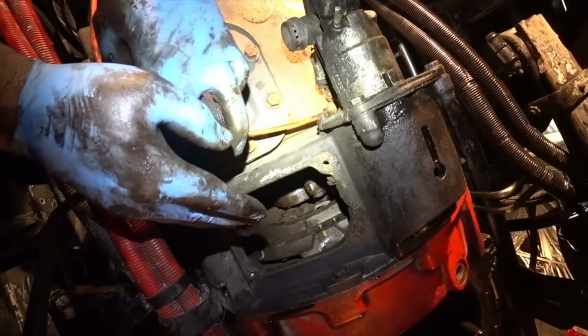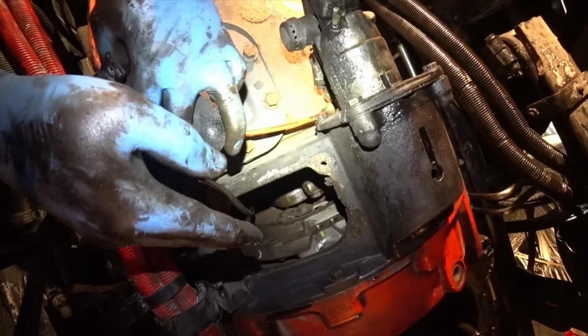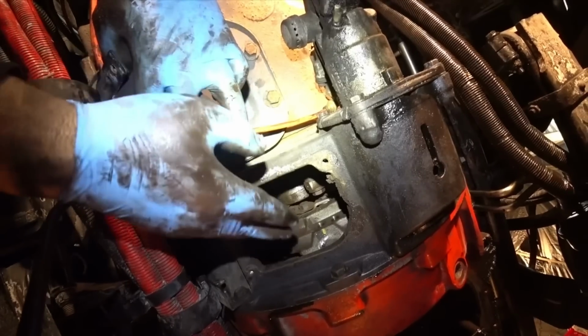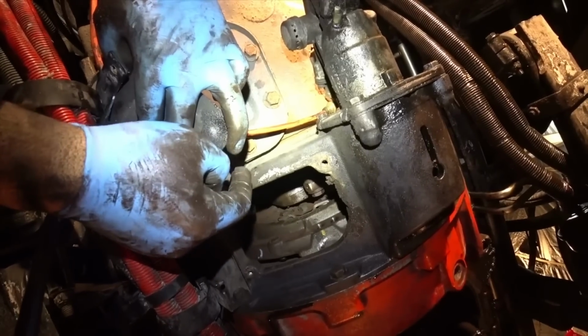You need to have that because that gives you a little bit when you put your foot on it, so it's not disengaging the clutch every time. If you're going through traffic, you need to set your foot on it, whatever. But when it's adjusted right, then the clutch brake will work. And this one is not. This one has no free play. That's why I have no clutch brake.